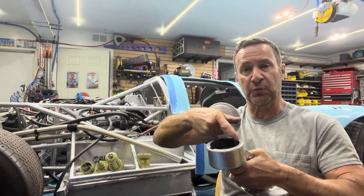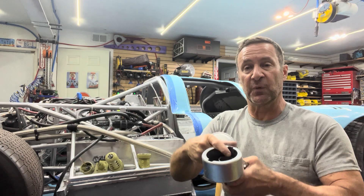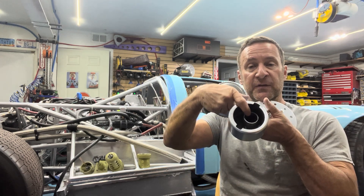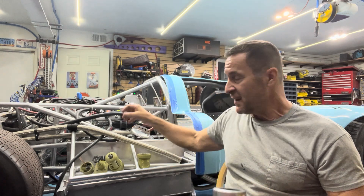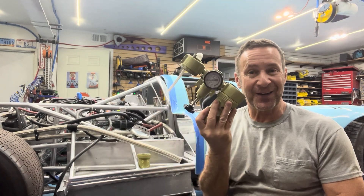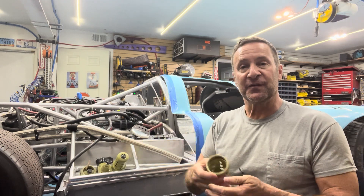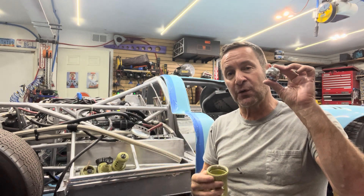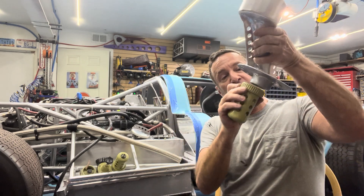When you open it up, you can see they had a big 100-millimeter opening because they use giant dump cans to fill these. For use with a standard gas pump, I have this tube right here. Everything is gusseted, and for safety I cannibalized an air compressor filter — which is aluminum — and got a one-and-three-quarter-inch ball bearing that drops into this cup when I'm refueling.